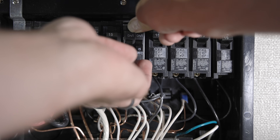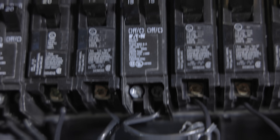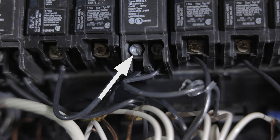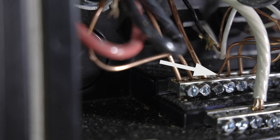Something I wanted to keep in mind was not to mess with the breaker panel too much — I didn't want to end up with two ACs on one hot leg. I found a breaker slot where I could swap things out and add a 15-amp breaker. When making those connections, the existing circuit gets connected into the breaker, and on the open slot we connect our black wire feeding our new outlet. The neutral white wire goes to the neutral bus bar and the ground to the ground bus bar.